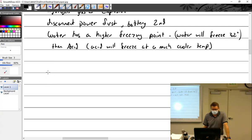Okay, where was I? Electrolyte level. Inside of the battery, here's the top of the battery and here's the cap. The plastic will come down, and sometimes it'll come up just a little bit like that. But the electrolyte level, some things will say to the bottom and some will say about an eighth inch below, which is nearly touching. I'm sorry, I think it's 3/8. Yeah, we'll go 3/8.